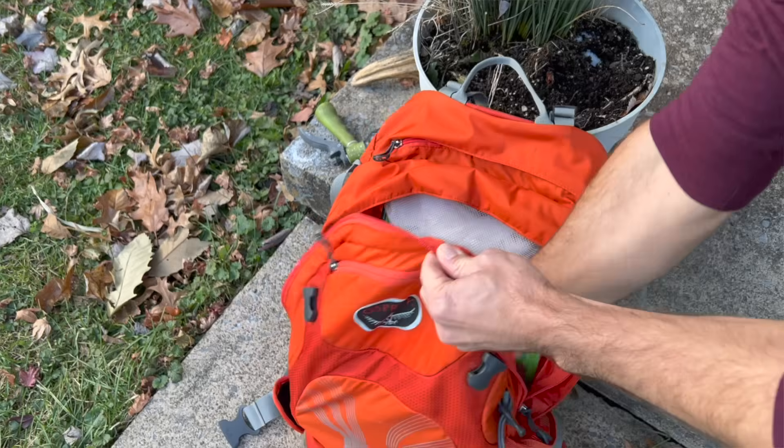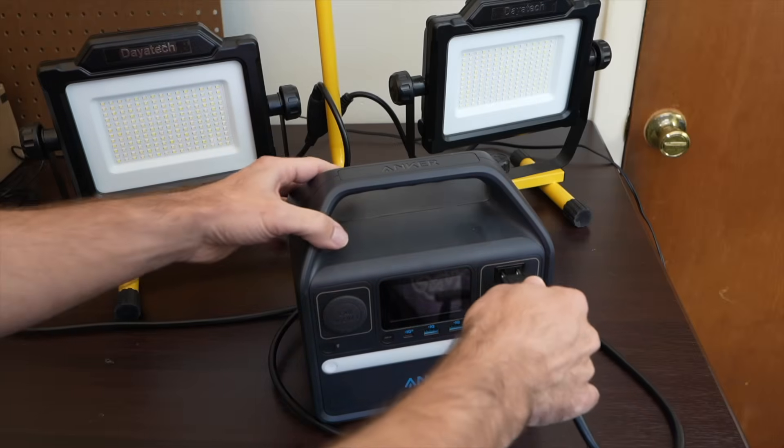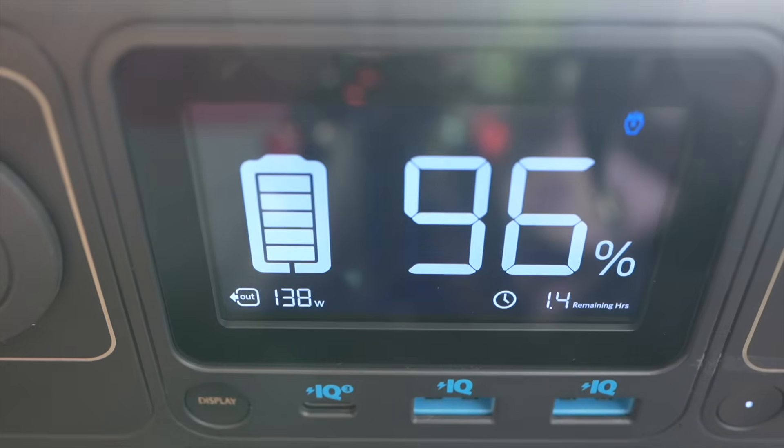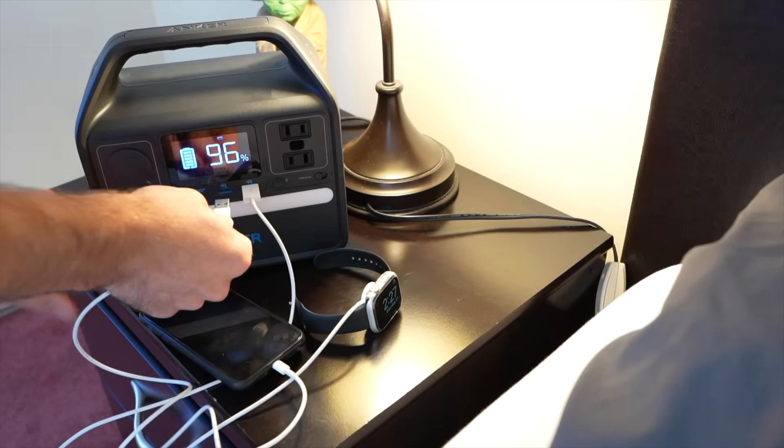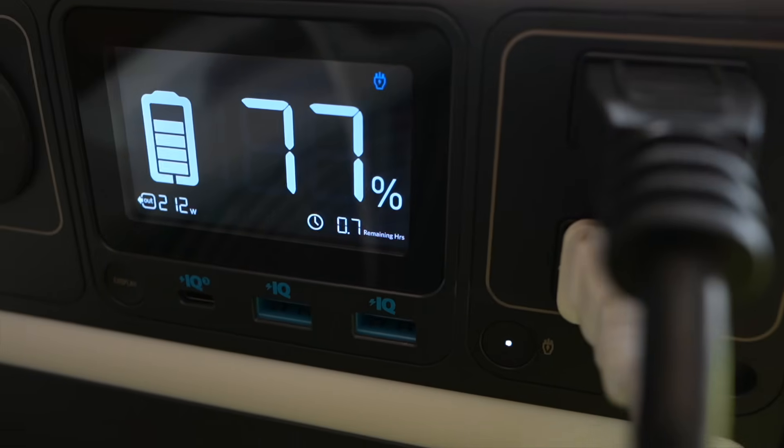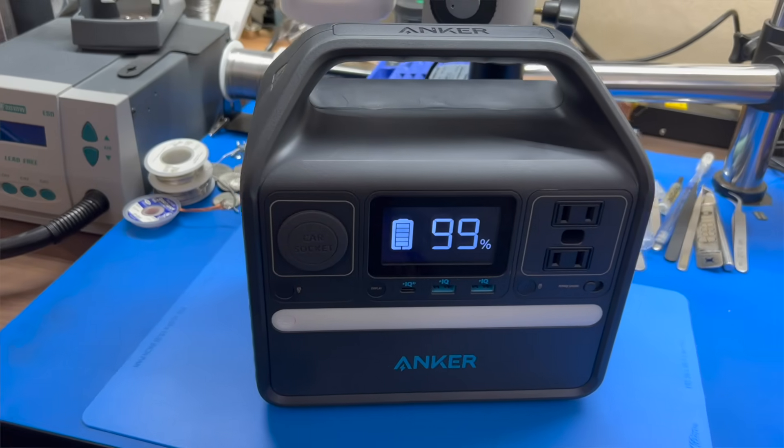What can you do with one of these? It's important to know what you want it for. You can literally carry a power outlet wherever you go. I like to test these units with my 20,000 lumen LED lights — they're super bright and they use about 140 watts. You can use a setup like this to light up your entire yard or campsite, or use the 12 volt DC port to run a portable refrigerator and keep food cold for four to eight hours or more. Or you can have it by your bedside for battery backup or when traveling to charge your phone or watch. In my tests, I got a sustained output over 200 watts from the AC ports while running a box fan and my LED lights. But note this is not enough power to run a normal refrigerator or microwave. Think about how you'd plan to use it, and if you're unsure how much AC power something uses, get a kilowatt hour meter to see if it's under 200 watts.